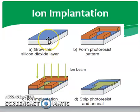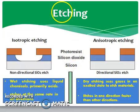In the next part, this developed photoresist area can be implanted. So the next step is ion implantation — we implant the ions. If you want to make a p-type or if you want to make an n-type, we implant the ions according to the device requirement. After removing the photoresist — this is the stripped photoresist — we are ready for etching. In the next step, these unwanted strips can be etched. So the last step is etching.